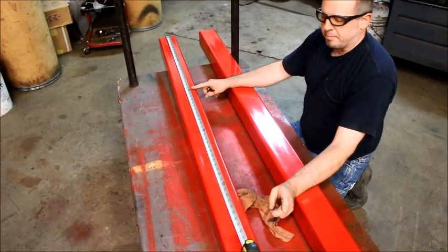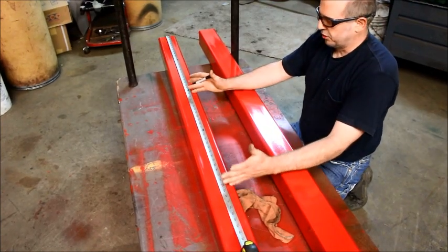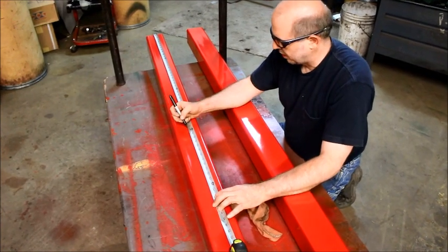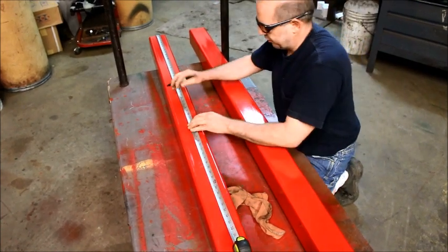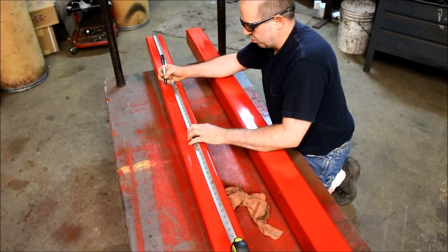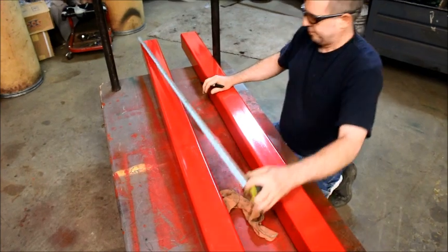If you include a water barrel system, you're going to be 22 inches total, so 11 inches off center. So we're going to add that now since we have a barrel kit. So 47. That's going to be the center of your upright, where your barrel is going to rest on. And we'll take away 11 here, so we're at 25.